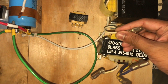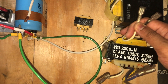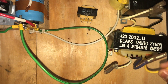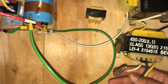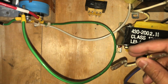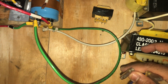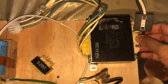You can see this particular transformer has only two wires on the input side. This is the primary high voltage winding; it goes to 115 volts. This side is the low voltage high current secondary output. Usually most UPS transformers output around 15.2 volts AC to 17 volts AC.